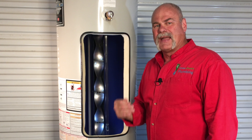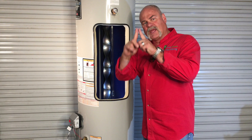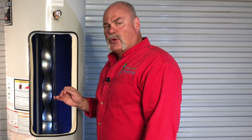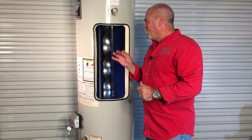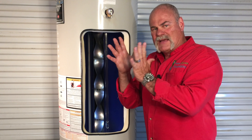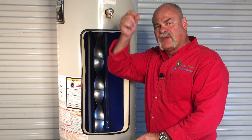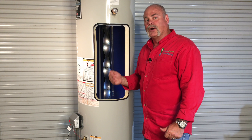This helps keep the calcium and magnesium from building up in the bottom of your water heater. If you can see around here on the backside, that's your anode rod. On the Bradford White water heaters, that's also where your hot water goes out — so when you hook up to that male adapter, the hot water goes out right at the top, and then the anode rod is down at the bottom. The anode rod is very important. After the first year or so, it's a good idea to change it out. The anode rod is a sacrificial rod — if there are any cracks or microscopic holes on the inside of the tank, the anode rod will sacrifice itself and plug up that hole. When you pull out the old anode rod, you'll see it's dissolved from the bottom up. They are made to make your water heater last longer.